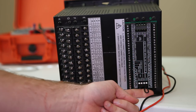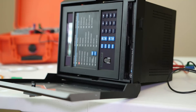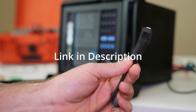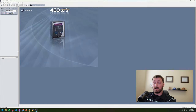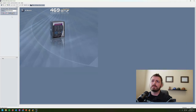That jumper will prevent you from pulling the settings out of any port or from changing the settings on the front panel - they do that for security reasons. Now all we need is to connect a generic USB-to-serial adapter - an RS232 to USB adapter. The set point access light being on tells me I'll be able to change settings once I get into the software. Unlike the SEL relays, there's really not a lot of serial settings to worry about on these - all of the ones that use a serial cable have the same RS232 settings: 8 data bits, no parity, and 1 stop bit.